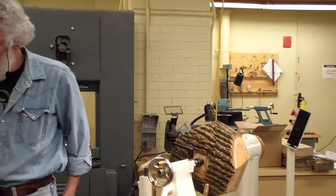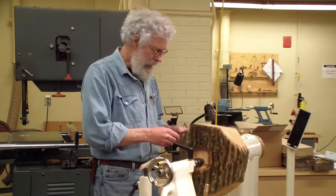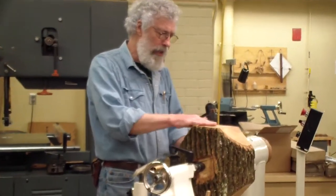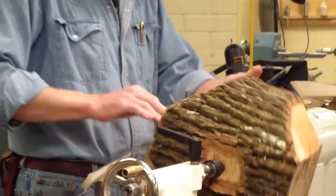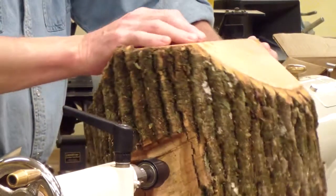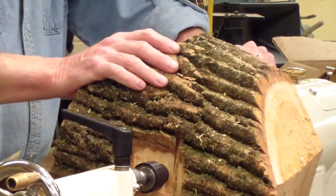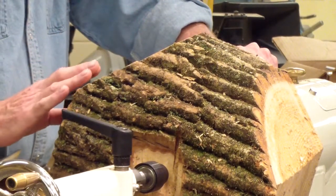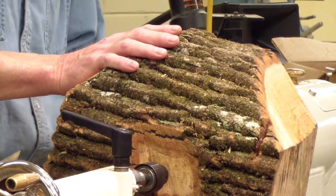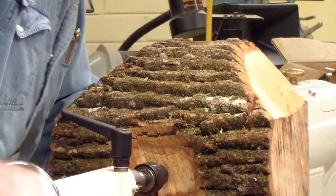The first thing I want to do is, I just threw this up here a little while ago, and I think I got lucky, but I'm going to compare things so I can get it balanced. So this plane here on the end grain and this plane here on the end grain on this side, let's just see how they come about. They're right on target, so I got lucky there. The outside, the curve could be different, but I'm on the pit there, and I'm about ½ an inch too high here, so I'm going to drop it by ¼ inch just to get that balanced.